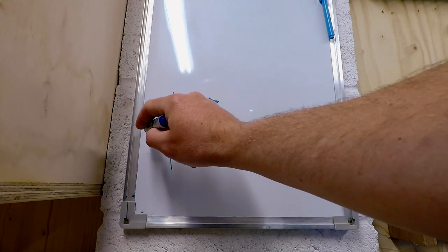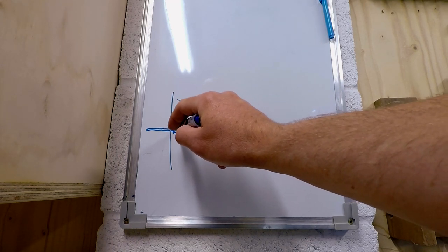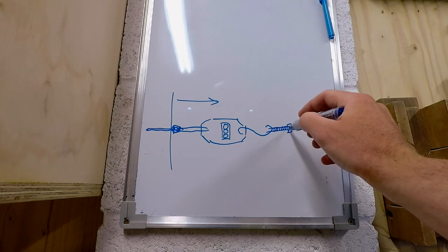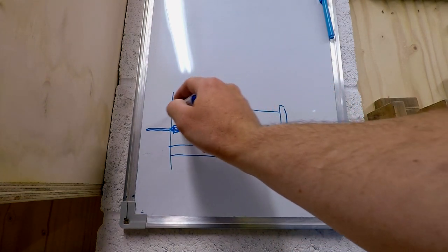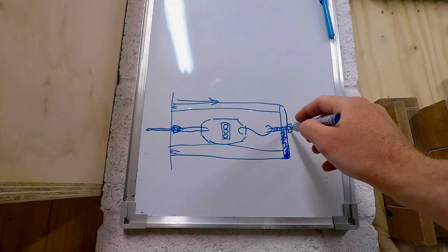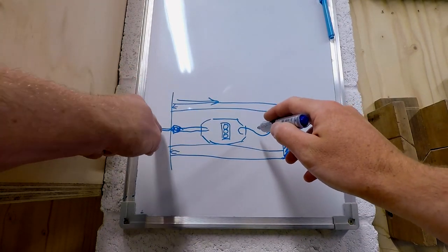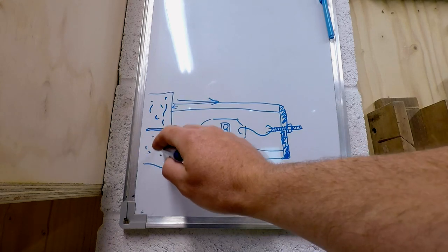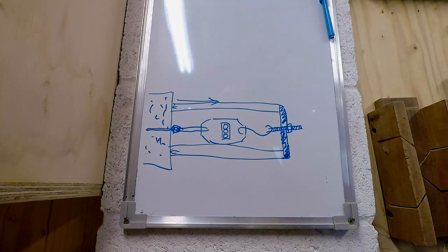So let's imagine we've got a bracket or a screw or something. I need a way of attaching the scales onto that. What I'm thinking is something that attaches onto a bolt. And then I just tighten that bolt, and that'll all be part of a frame that transfers the force to the wall here. When you tighten this bolt, it puts force through the meter, tries to pull this thing out of whatever object I'm in here, and that could be anything. And then I can get a measurement on there of what sort of pull force it can withstand.